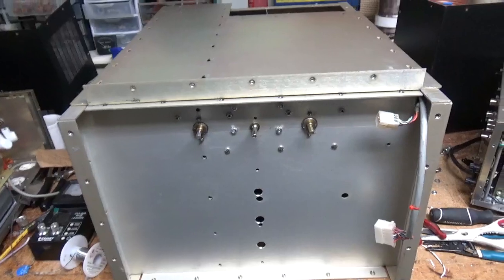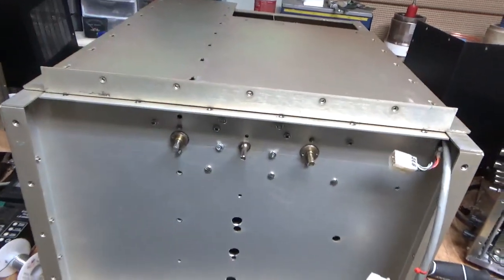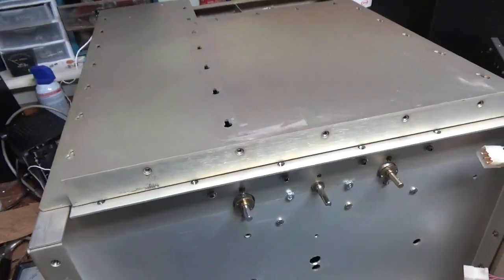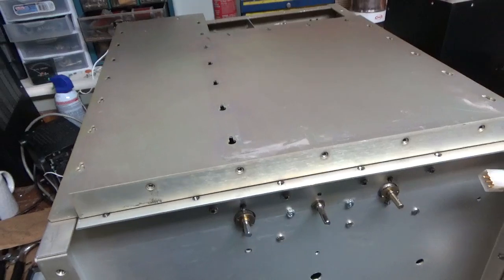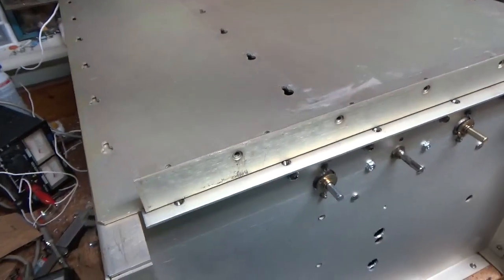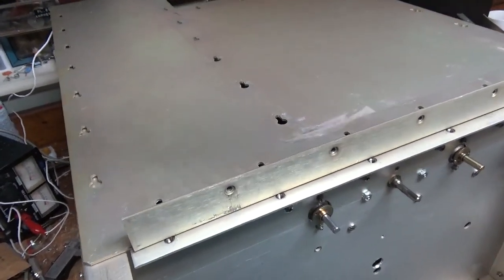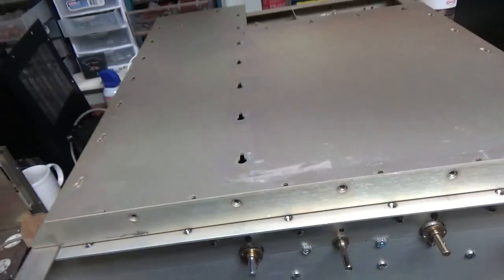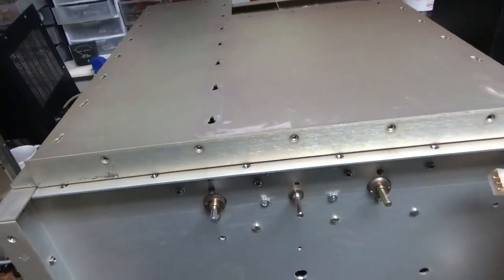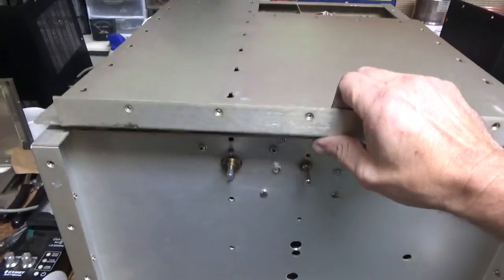So I'm back. I spent a bunch of time today getting the coil to resonate on 160. It's fine-tuned to cover between 1.875 and 1.975 flat. It just goes up a hair when you go below or above that. I'm going to show you everything I did — I'll take the cover off.